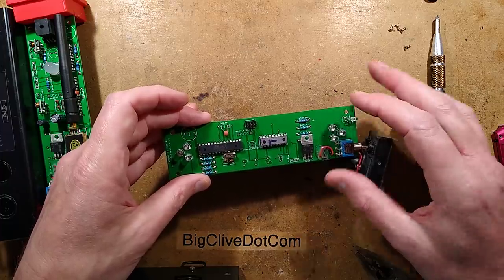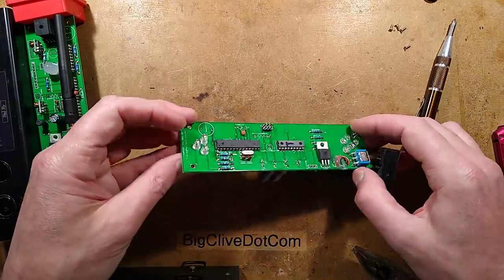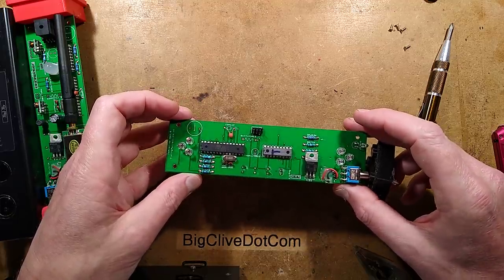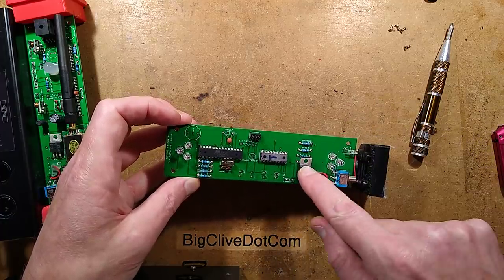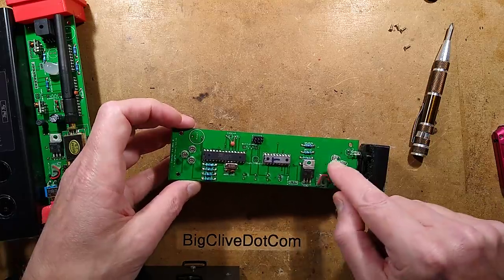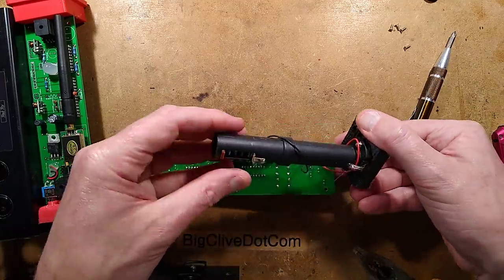There's an LED battery warning, but they've not actually used it. There's the cluster of three LEDs up there — there's the power-on LED, and the cluster of three LEDs, I guess they're in parallel, maybe with a resistor each. Unless this is being used to switch — oh it's a FET! This is being used with these resistors before the LEDs — the FET is being driven and is pulsing the LEDs in that code. This is nice construction, especially for something so specialist.